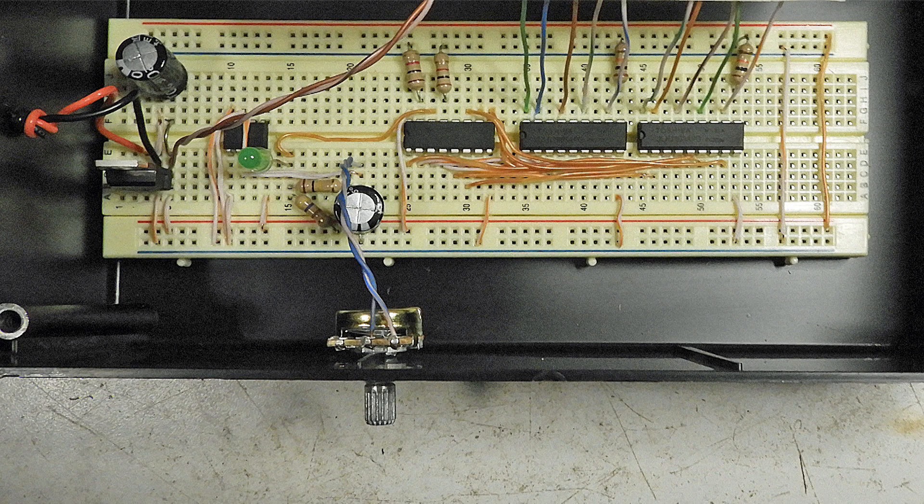Here is the build for one of these. I made two of these for them, so they've got 20 outputs and can put two LEDs on each. They've got about half of the diodes right now. All the way to the left is the voltage regulator, then the 555 timer, then the 4017, then the two 8-array NPN Darlington amplifiers. I gave them a picture of this in case they happen to pull out one of those wires, so they can tell where it's supposed to go.